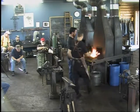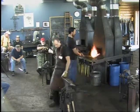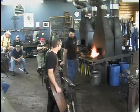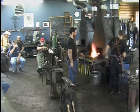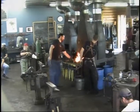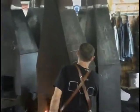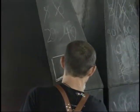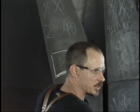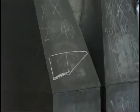And we'll start again, just tapering that end out. In this case, I'm really specifically wanting for this horn to have a shape where it's one taper starting and then another taper coming away. This one being much less of a taper than what that is. I'm specifically looking for that in a square form before I round it up. That's what creates this nice shape right here.